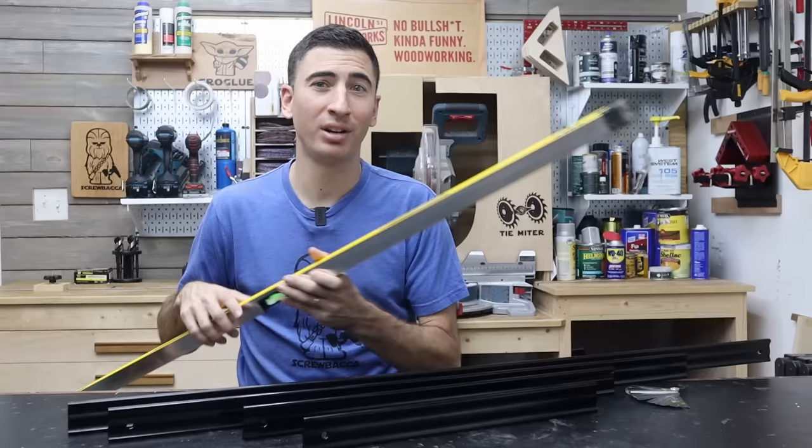The biggest consideration you want to look for on your first knife is a blade that's flat on the back, so you can cozy up against the side of your stock. Remember the etch graduations from earlier? A marking knife easily slips in and ensures an accurate transfer.